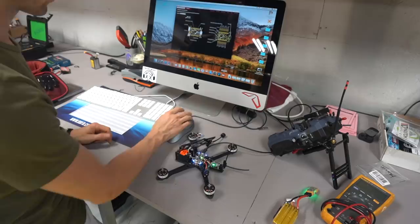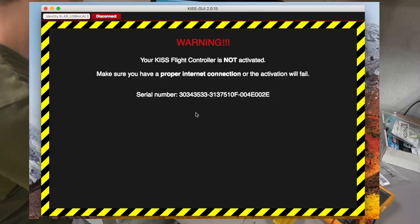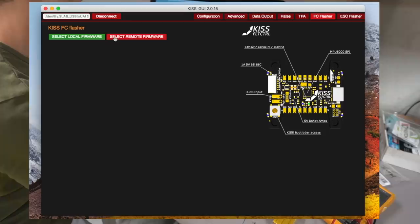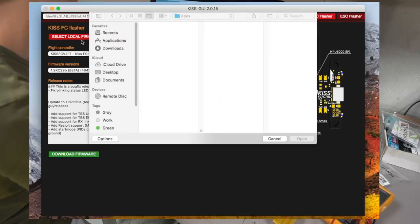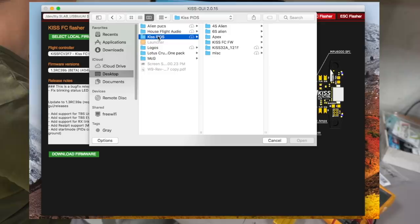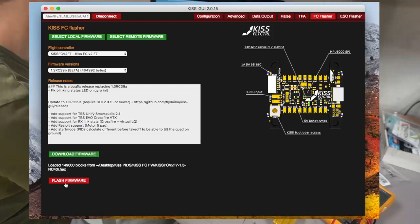What we're going to do is go here, connect to the KISS FC. We can do all this stuff while we're, just make sure you don't interrupt that bind process. We're going to go to the FC flasher and flash on the latest firmware. I can select a remote firmware, I think it's available now. 39B. Nope. So there is a firmware, which I'll put a link to in the description below. It's called 40i. So if I select local firmware and I have it on my desktop, and I go to KISS PIDs and then KISS firmwares, there's this RC40i hex file, and then I hit flash and that's going to start flashing.